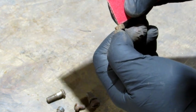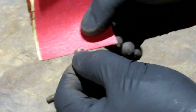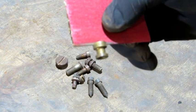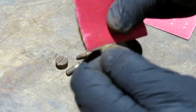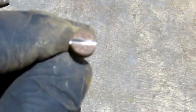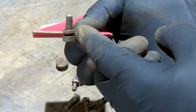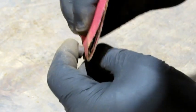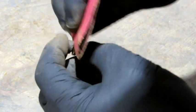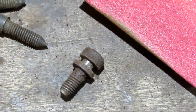Remove the rust and crud on the inside of those screw notches. If you have any burrs, they'll be on the inside and outside of the screw slot — this is how you take the burrs out. You do your brass nut slots the same way as the regular metal. Turn the screw a couple times while sanding. Now all my screw slots are looking nice and shiny. I'm giving a little extra attention to the frog adjustment screw — folding paper to fit inside that slot that runs around it, just like the screw slots. Make sure you refold your paper so you always have fresh sandpaper that's still working.